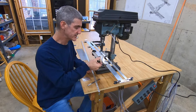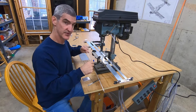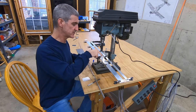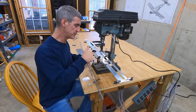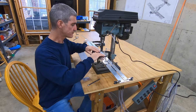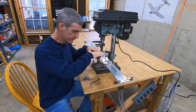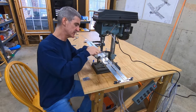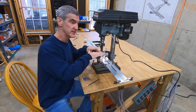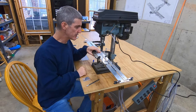I've got two strips of aluminum that are the same thickness as the thick edge of the wedge, and then a thinner piece that acts as a shim. Everything's perfectly spaced and clamped down so that when you fit the wedge in here and hold it up against this guide, it's perfectly flat and level. Put a straight edge across there and it's all going to be perfectly flat and perpendicular to the cutter. It's all set up and I'm ready to go.